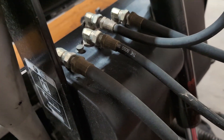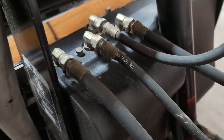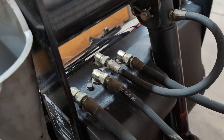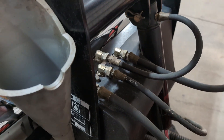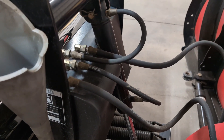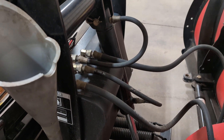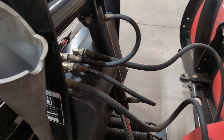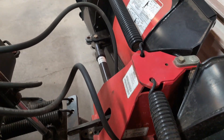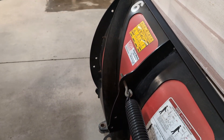Underneath the headgear cover on the hydraulic tank, there is a breather cap that lets the air out, and it's important that that breather cap remains intact. I've seen people try and take it out, thinking that's where they fill the oil. They break the breather cap, and then you end up getting moisture into your hydraulic system. And once there's moisture in these lines, if it gets cold enough, the moisture in the fluid will actually freeze, and your plow will cease to function.